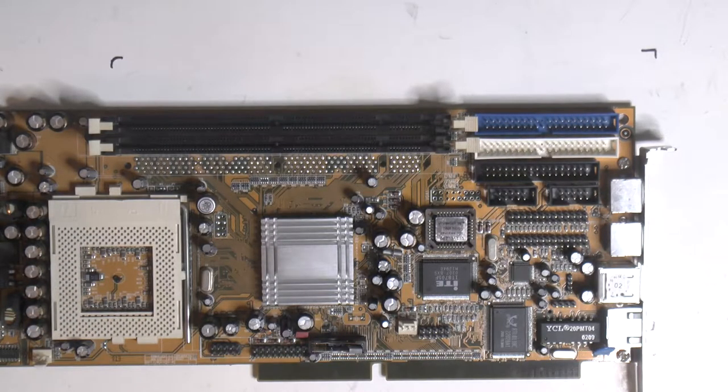So we need to make a ribbon cable that's 15 wide. I don't think we need only like 12. A lot of the new cards, like modern cards, only have 12 wires on their adapters for some reason. But that's because a few of them are not connected. One is optional and two are not connected, if I recall.